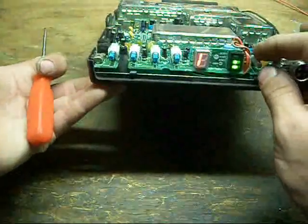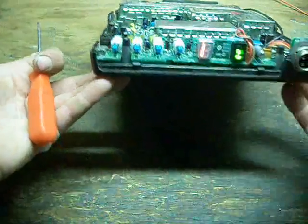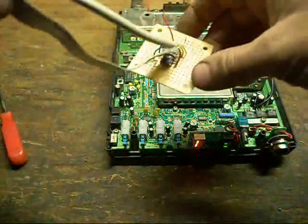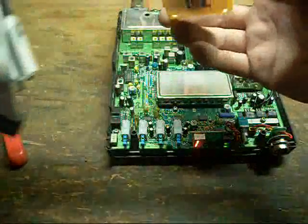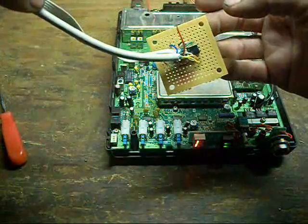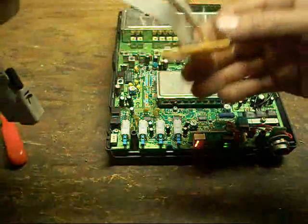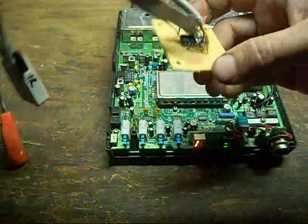I had to go with the normal programming port. And one thing I quickly found out researching the programming cable for this unit is that the schematic they have is painfully wrong. They have the Max 232 IC on the schematic where the RS-232 level output is going to the TTL side, and the TTL side output is going to the RS-232 port, which is backwards. It'll still work, but it will work in spite of itself.